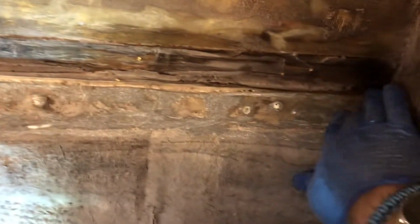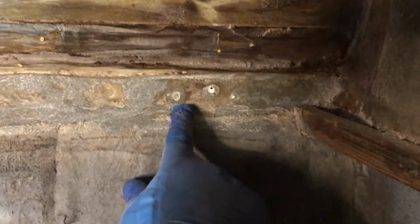But this here is then the superstructure, and it is very, very thin. I think it's only one or two coats of fiberglass. So what I'm going to do is fill this with epoxy to get a fillet and to smooth all this off here. Once I've done that, I'm then going to fiberglass from here down and over to here, so that I make a join.